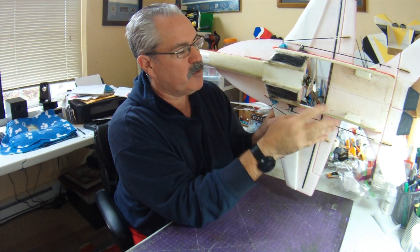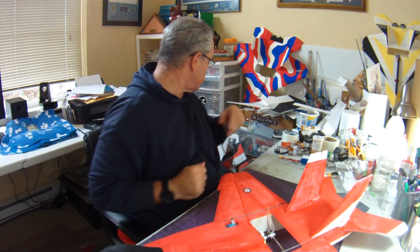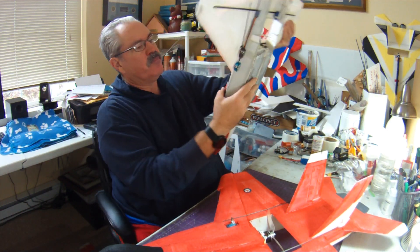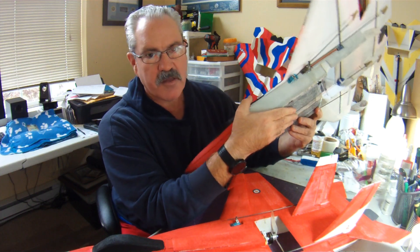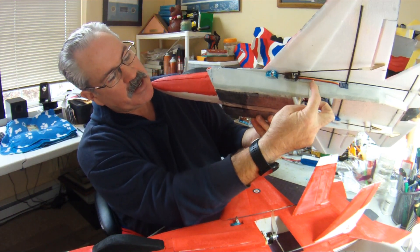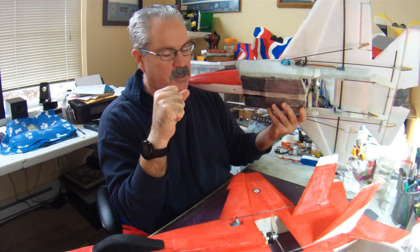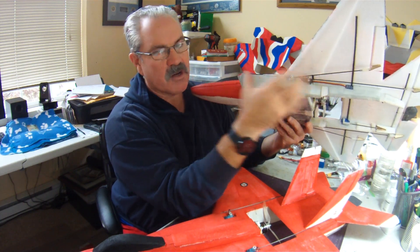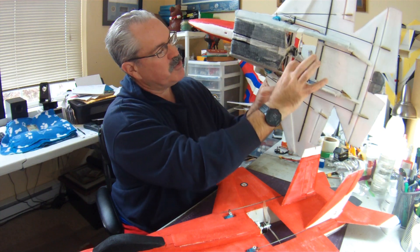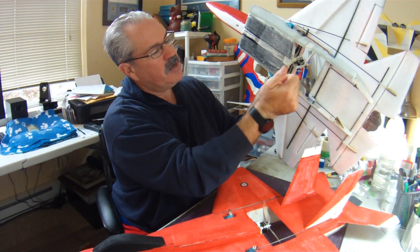On this F-18, it wasn't too much of a problem — these pieces are pretty much perpendicular to the wing plate, so I didn't need to worry about that too much. On this F-35 version 5, it's originally a 30-inch wingspan and I wanted to downsize it to use a quad racing motor. I originally thought I'd be able to spin a six-inch prop. As you can see, I had originally cut out some relief where this white foam is so it wouldn't interfere with my six-inch prop, but it caused me quite a few issues. I'll have links to my discussion videos on both the F-18 and this F-35. That prop clearance was kind of the sticking point here, so I ended up having to go down to a five-inch prop.